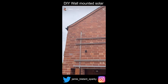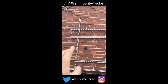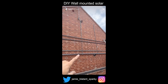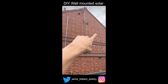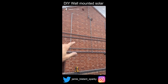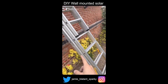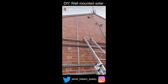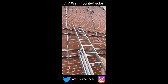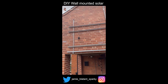I've put two fixings in the end of each one to stop the fall-down effect. The rest are holding the weight, and the bottom rails are on the weight. Hopefully I've got enough fixings there and the gable end will take it. My top rung is already two or three from the top, my bottom rung can go up. I think I'll get all the fixes done but I don't think I'll get the panels on with these ladders — that's why I'm only going to get five up this weekend. I can stand here, flop a panel, and strap it quite safely.